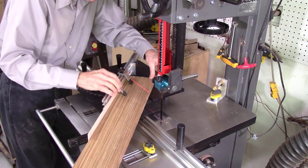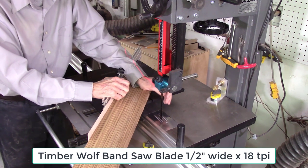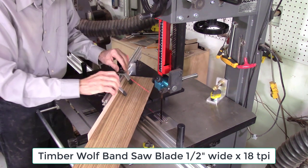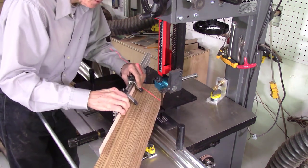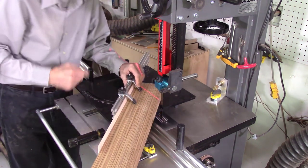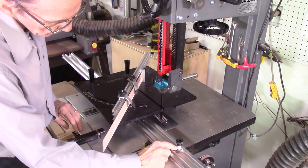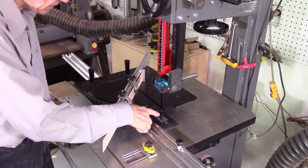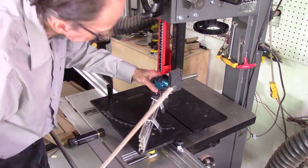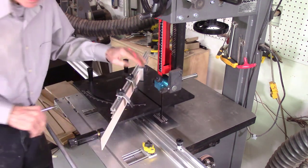I want to clamp close but not touching where the blade is going to cut through. On this bandsaw I have a half inch wide blade, 18 teeth per inch — this was left on from my previous project, so it may be too fine and I may switch to a coarser blade. I have my stop set up so I don't go through the board the whole way. I made a new stop using a round thumb nut with a screw that goes in the slot and a spacer — just the right height that it hits the table but is below the top of the table. Now I'm ready to cut my board.